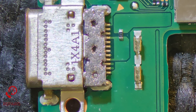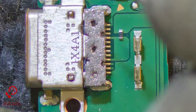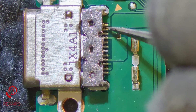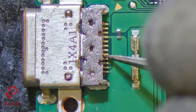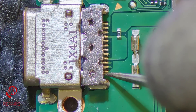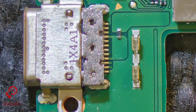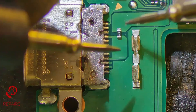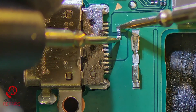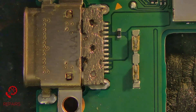The pins on the back are looking pretty good and pretty solid, which is good news. We have the indestructible fuse as well, so I'll just go and check that. We have continuity through the fuse, so the fuse is all good. Let's check the actual port.